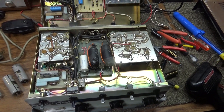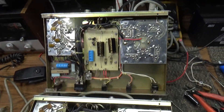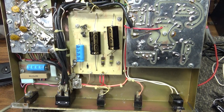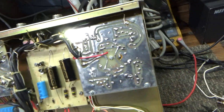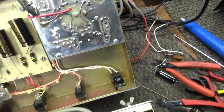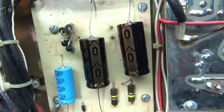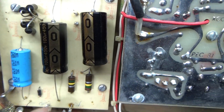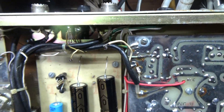This is a quick tale of two Palomar 300A chassis. This one I picked up recently off eBay, already recapped it, and it has some bad diodes in it. Here's the diode that was in it — it's a bridge configuration, actually a bridge rectifier, which is one circuit with four diodes, and it fits right across here.